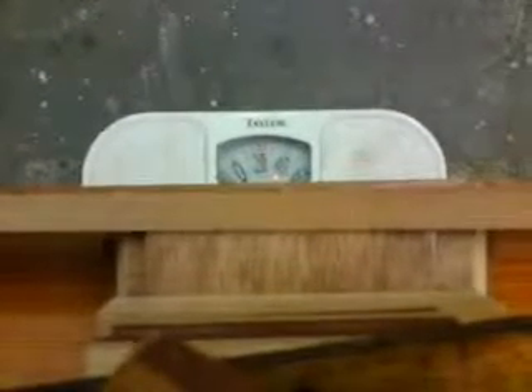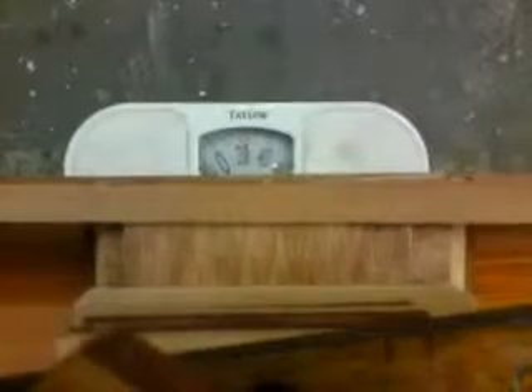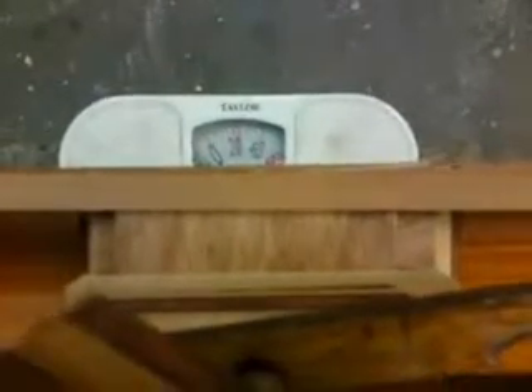I think we're not doing too bad relative to our overall weight, but I think we might want to cut up a few more pieces and see if we need to be vigilant about how much weight we're putting into this boat. After taking a look at our weight for existing components, we're going to rough-cut the remaining next heaviest components, which would be the plywood pieces for the bottom and the deck. Keeping in mind the strength of straight grain, the plywood surfaces of these boats actually comprise a good portion of the strength of this monocoque structure, so we want to pick out pretty decent pieces.